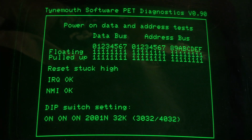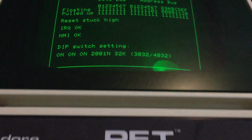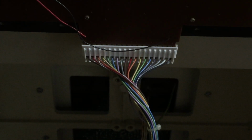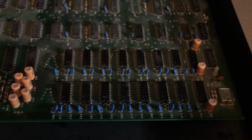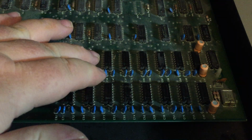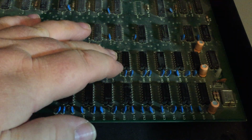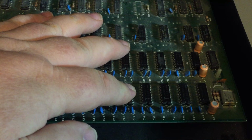So I'm thinking what I might do right now, I'm just setting the 6502 chip from this machine up and away. I think what I might do is just open up, pull out the thing, and then get this pointing way down at all the little RAM chips. There we go. There are the RAM chips, and this is still running. And what I'm going to do, to just get an idea, is see if I feel anything tragically warm, because that is often a sign of trouble.